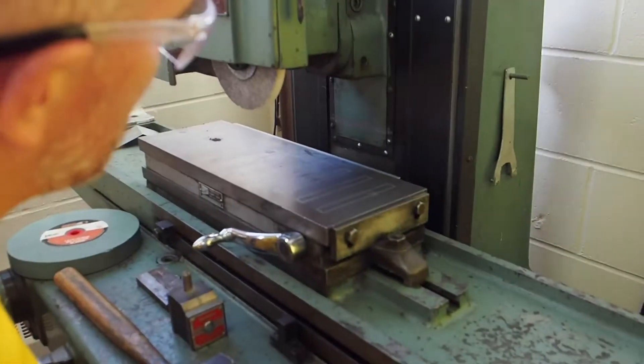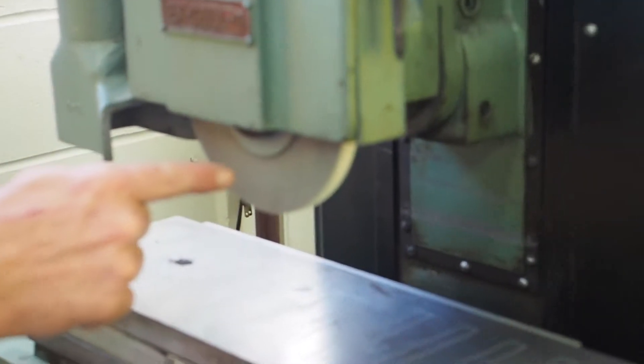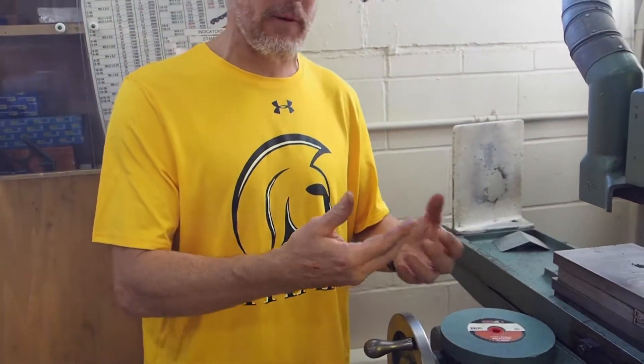Where are the moving parts? The wheel right here — that's it. The surface grinder is probably the most dangerous machine in the shop. It can throw pieces off because this thing is spinning extremely fast. The rotations per minute are amazingly quick. If you get your hands on this it won't actually cut your hands — it'll burn the skin off of your hands or your arms, and then there's really nothing left to stitch up. It's a very dangerous machine, much like the belt sander.